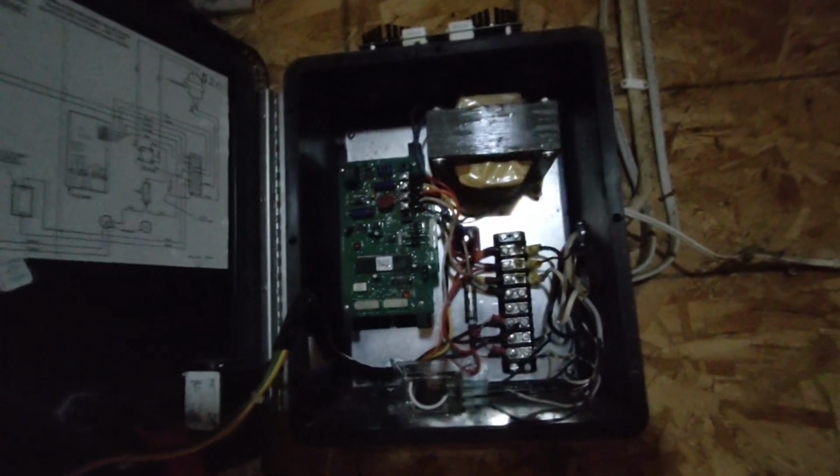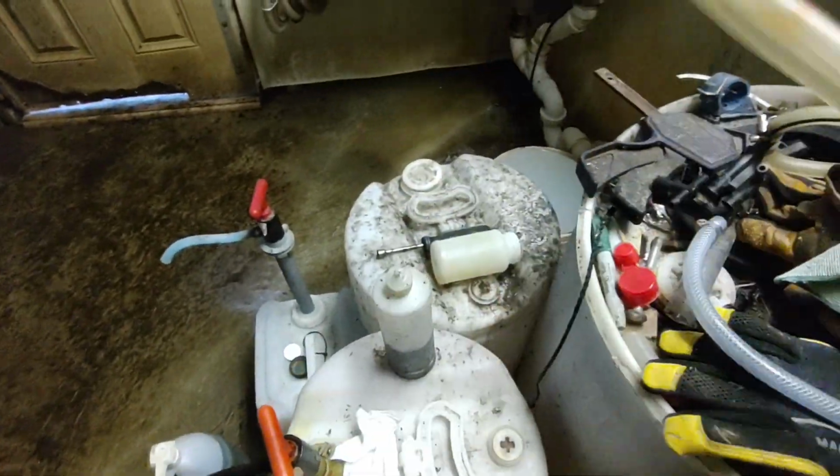I'm checking that. So that's what I'm going to do right now. I switched some wires. I'm going to run it for a milking or two, see if that makes a difference, if I start having problems on the back quarters. I made these adapters so I could run off the one pulsation. I just thought this morning while I was monkeying around, if I'm continuing having problems, I'm going to put both these wires onto the one terminal, and then that should pulse both sides at the same time and should eliminate that problem until I can figure out more what was going on. So that's where I'm at on that right now.